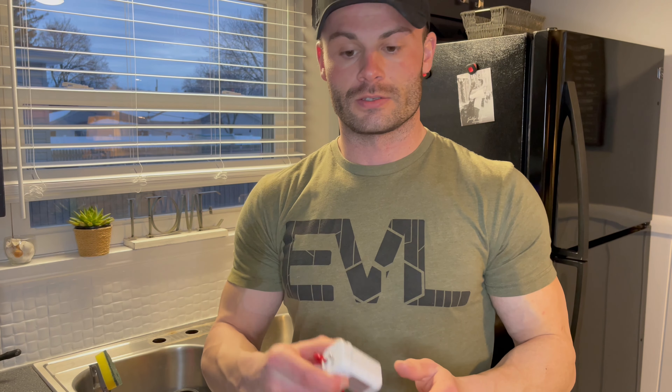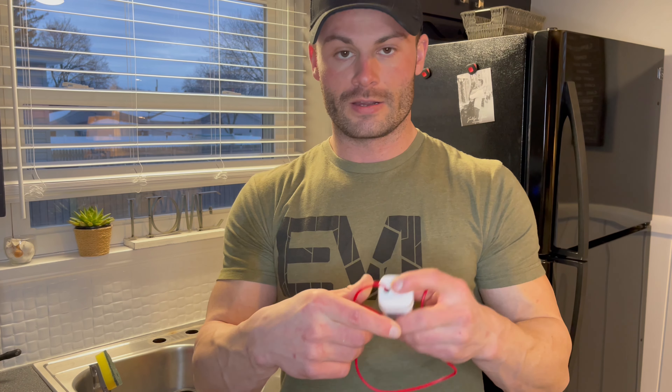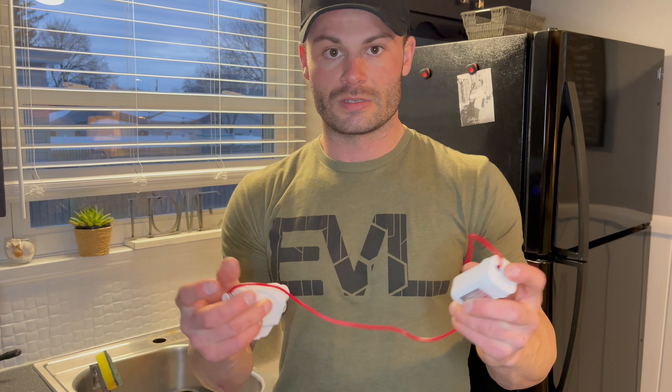That opens it up. This just takes four AA batteries that you put in there. That powers the motion sensor that you can activate the sink with. Put the batteries back in there, screw it in, and then this piece is good to go. Everything you need to install this comes with the package. You have your cold line and your hot line, and you'll see at the bottom here that's where they screw into — they just screw right in just like so.